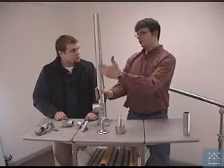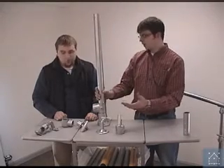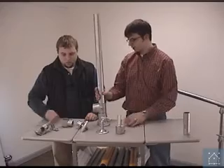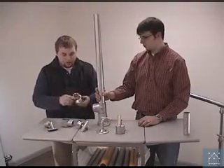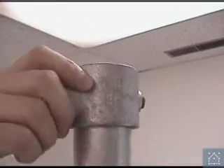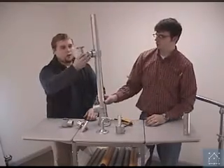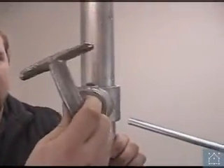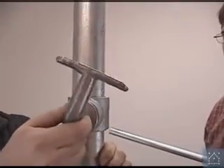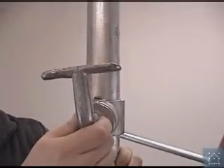Another thing we have when building an ADA rail — though it's not required in every situation — is a mid rail. The most common way to attach a mid rail is to use a fitting like this, which slides onto the pipe, is set to whatever height you want, and then you'd use a fitting that slides onto the side of it. This fitting is unique in that it can be turned any angle you need, which allows a lot of versatility. You can order the same parts and if you have to go up and down a grade, you can still use the same basic components.